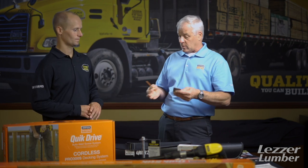What that means to a contractor — features and benefits — your basic H2.5 install: he's climbing up a ladder, dragging an air hose, putting 10 nails in that hurricane clip, and then the drywall contractor's mad because he has bumps going down his wall. That whole process is anywhere from 45 seconds to a minute and a half. With this screw, that same guy goes up the ladder with a battery impact drill — four seconds, and it's a good connection.